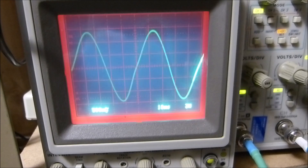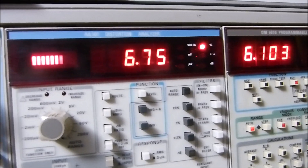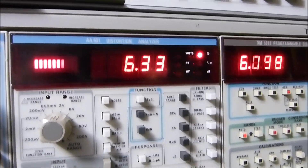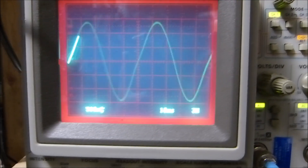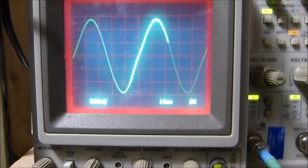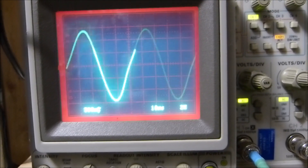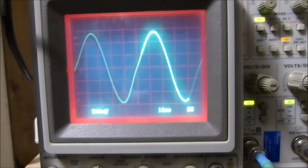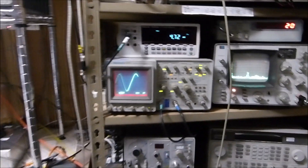At 20 Hz — there it is. Power drops slightly; distortion at 20 Hz is around 6 or 7%, but I don't find anything in there that I think would sound offensive. It is not low-frequency deficient at all — it sounds quite good.